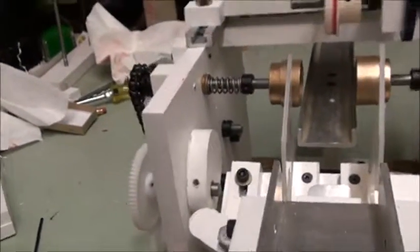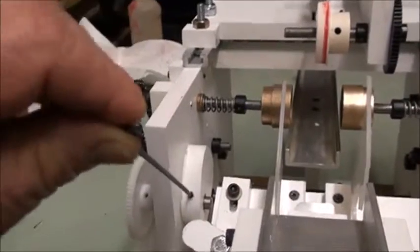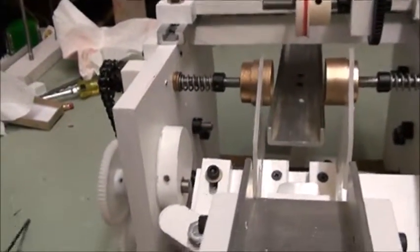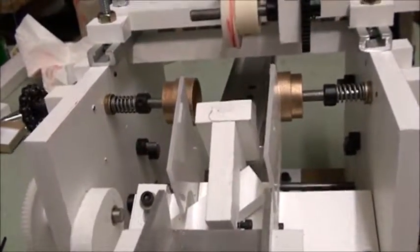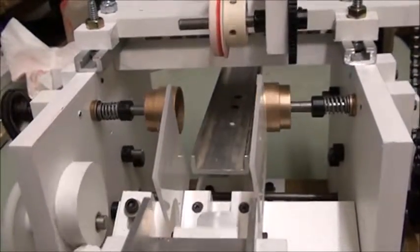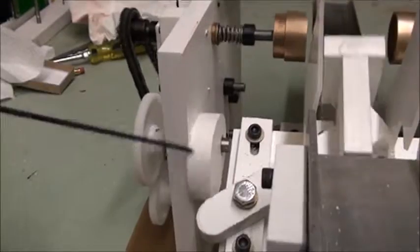But if I had to move it, I would go to there just like that, then loosen that set screw, and move it a little bit forward or a little bit back until I got it right. See how it goes up? It hesitates there a second while the cups come in and close it, and then pulls away. And that is done with this cam right here.